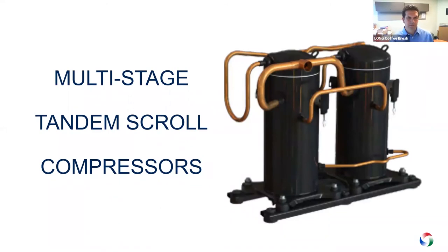You mentioned eight stages, but the catalog shows just two scroll compressors on each model. How do we get eight stages of capacity from two compressors? We're using a tandem set of two-stage unloading scroll compressors with offset capacity, developed by Copeland. The tandem consists of two two-stage scroll compressors mounted on a common rail and piped together into a single circuit. The compressors are not the same capacity — for example, a 10-ton tandem may have one 4-ton and one 6-ton compressor. The different combinations of being on, off, loaded, or unloaded result in eight steps of capacity control, with a minimum capacity around 30% for all unit sizes.